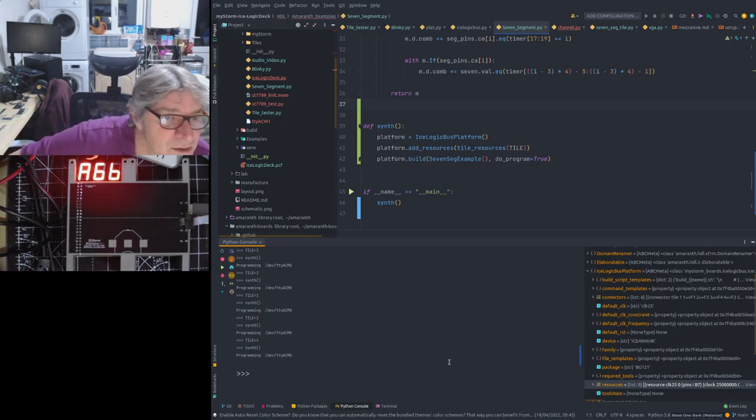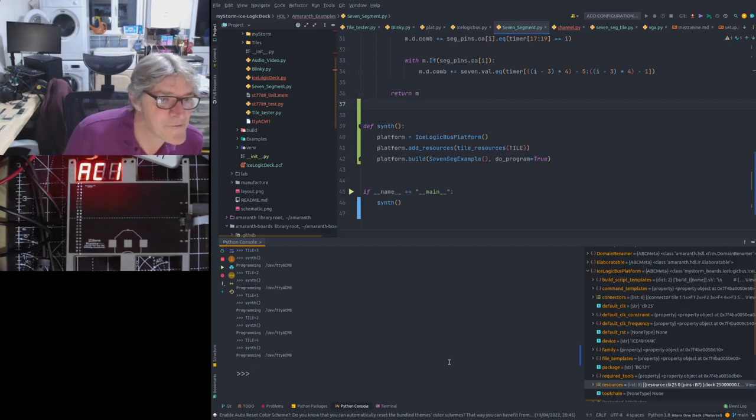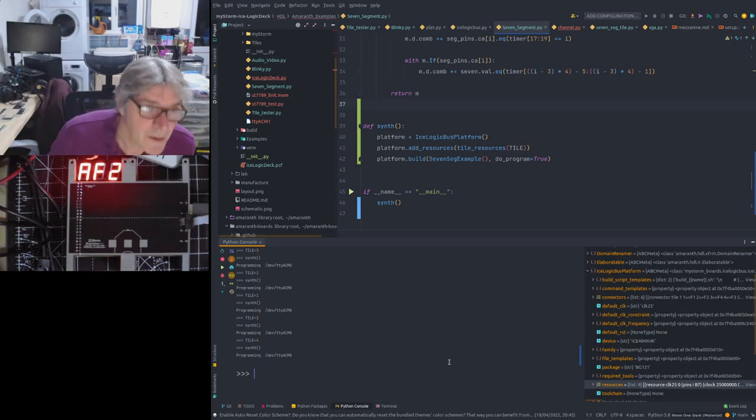Why have you chosen those connectors rather than something like Adafruit Stemma QT? Because the Stemma QTs don't have enough pins on them and they only really do I2C and GPIO. But one of the microblades I was planning would have one or two Stemma connectors on it. So there's a Stemma connector version of this. To answer your question, it's because these are more flexible than Stemma, because these can have Stemma cards.